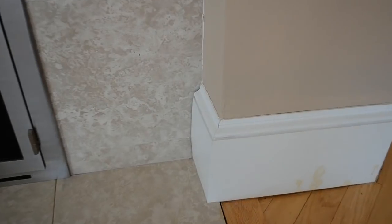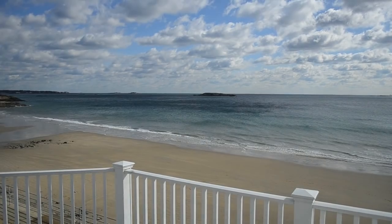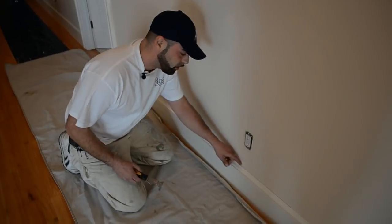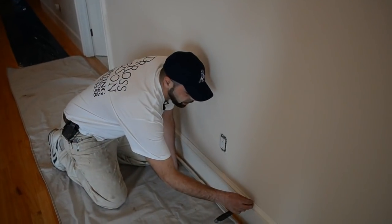This is a very common problem if you're in a climate where you have a lot of hot and cold temperatures, because of the expansion and contraction of the natural woods. On a wall that gets hit with sun in the morning after a cold night, it's going to want to pull away. So the caulking is now split and cracked. What you have to do is dig out the old caulking. Once you've cleaned out all the old caulking, you have a nice clean area.